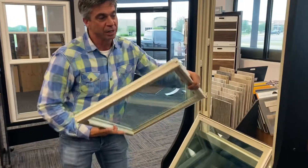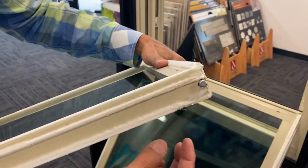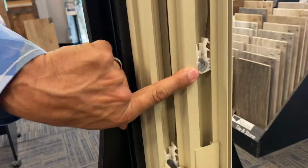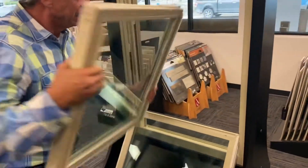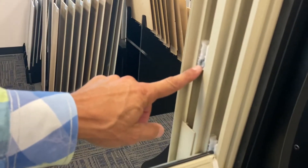The way these sash pins are set up, you can pull in close — they're flat and they have a little ring that wraps into the shoe. If I look in the shoe here, what I will do now is put in one — let's just say it's out of the shoe — I'll make sure it's flat. If this is not flat, like this, going up and down, take a screwdriver and you can turn it and make it flat.